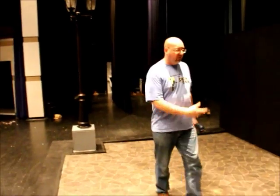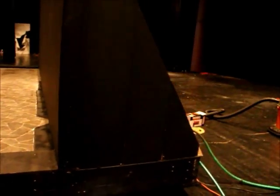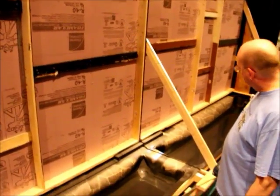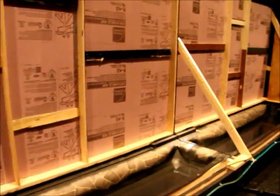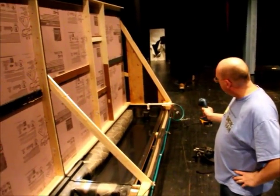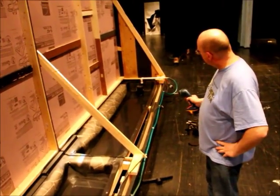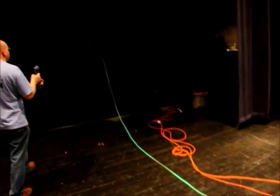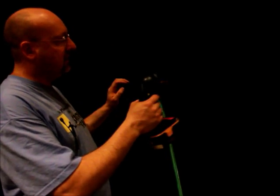Once the water runs down its slope, we come around to the back side and we come to two feed trays, each calculated at 74 gallons each — though we never actually fill them up completely, and it turns out we use less water than I thought over the course of the entire thing. We have two waterfall pumps, smaller duty, about 4 tenths horsepower. They pump out through some garden hoses to our back wall where I rigged up some pipes. They run along the wall and empty back out into our main tank where the water is recirculated up.